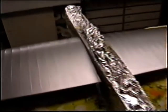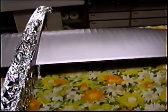Now see, here's another little imperfection right around here we're going to try to fix. But all of these are doable. Now I'll just take a brush later, take that little striping brush, go over that with a little rejuvenator, and then I can pick away. Again, I may want to sand this out again, maybe I won't. This is a dry spot. Right here you can see where I've got just a little bit. There's just not enough paint there, physically enough paint. Another spot I'll want to touch up.